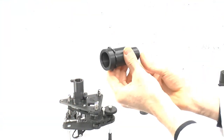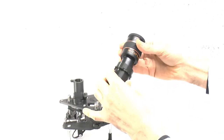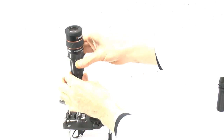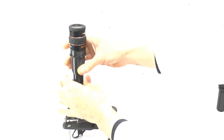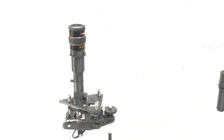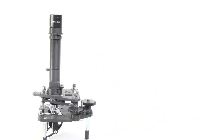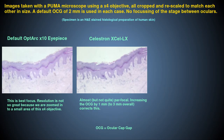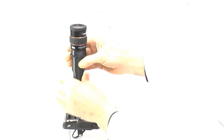The new tube is now ready to accept the eyepiece — insert it like so and attach the tube to the top of the filter block. Here is the standard Puma with a 23.2mm microscope ocular, and here is our modified version with the Celestron XL-LX. I can confirm that the image is almost parfocal when you swap these monocular tubes, which tells us that we got the measurements of the focal plane of the Celestron eyepiece correct to a practical degree of accuracy.